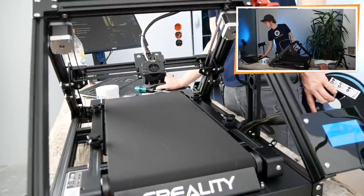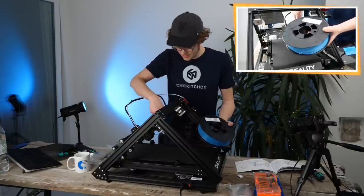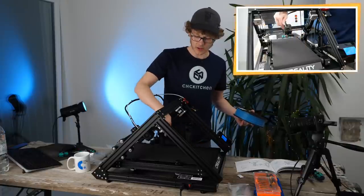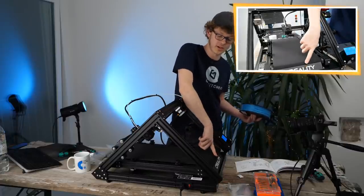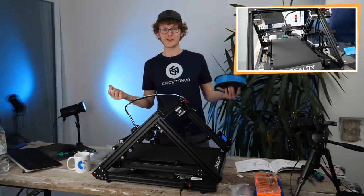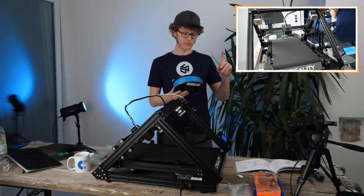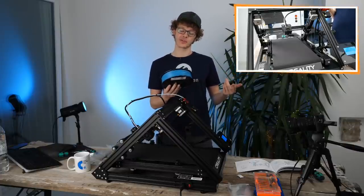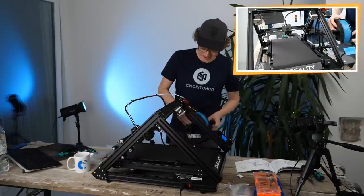Hexel's asking, will the belt be heated all over its surface? As far as I know, the belt will be heated, I think, up to this point right here, and then it will cool down, because it's important that the part releases before the bend right here comes. So that you can use the printer for this infinity printing. Which just brings me again to Tom's filament, which is, I guess, the perfect filament for that, because it's Infinity Blue for the Infinity ZXS 3D printer. What a coincidence.